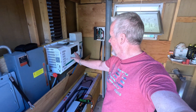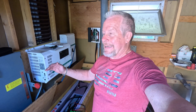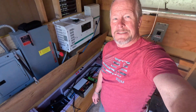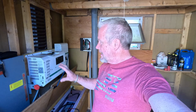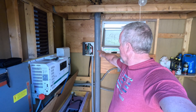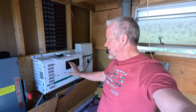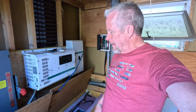The manual for this inverter is quite large. When it went to factory defaults, it wasn't good for lithium batteries — it let the inverter run too long and drained the batteries down too low. Once drained down too low, they went out of balance. So once we get them hooked up it'll run the rest of the day today. Tomorrow morning we'll check out the system and make sure everything's looking good. There are voltage levels for charging we can set up on this charger. This inverter also has a charger from the generator — that's the thing we didn't set up properly last time.